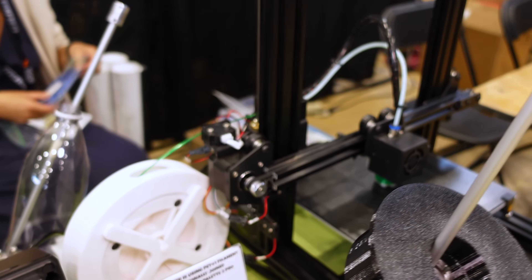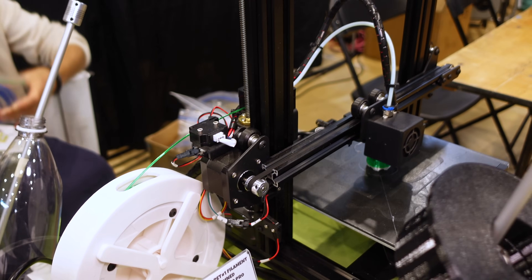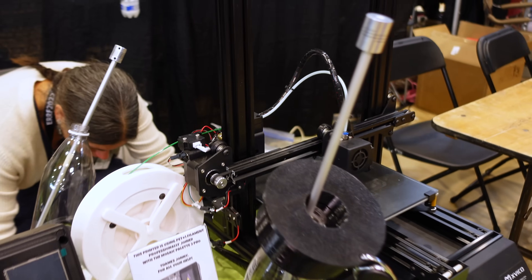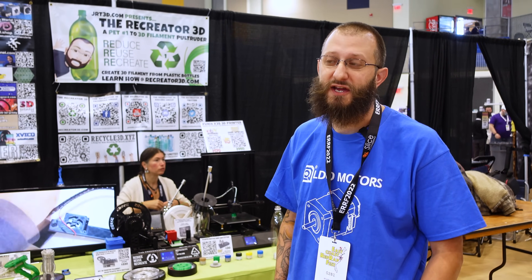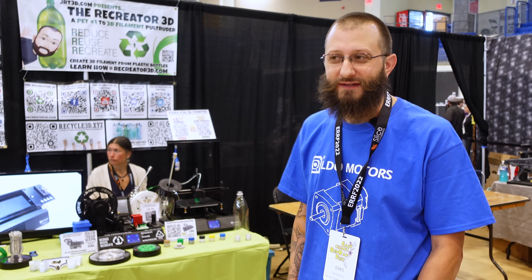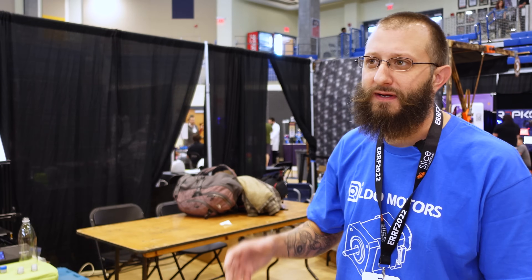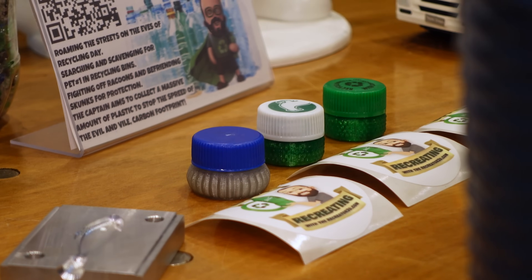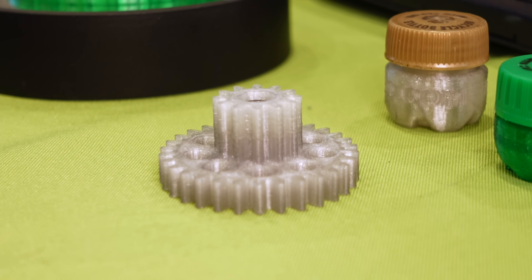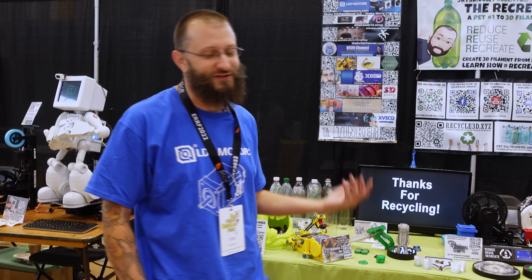I had so many issues trying to manually hand-join this filament because of the way PET material acts. It's a fine dance to avoid crystallization while also hitting a molten state — if you're manually seaming it, you could easily ruin a joint and it'll hit your extruder gear and break. I'll be working with a hand joiner from Wise Pro, and I'm looking forward to that for community members looking for a cheaper method.